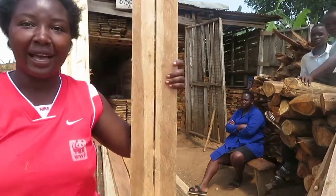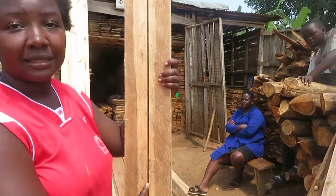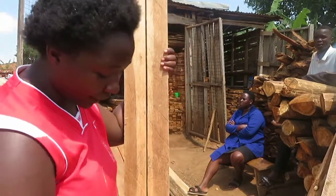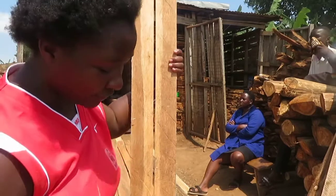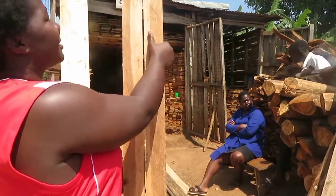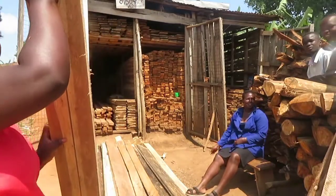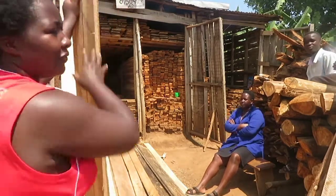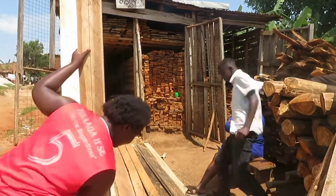This is three by two. It looks like a six by two, but what shops do is cut it in half — they cut it in between and don't divide it evenly. When you're buying three by twos, half the time they come like this. Make sure the person selling to you didn't leave a huge gap where they cut. The roofers told me: when they cut the six by two, the gap shouldn't be too big. They should leave very little space and cut it longer on the lower part.